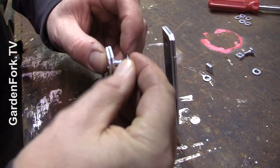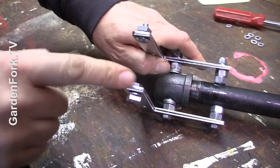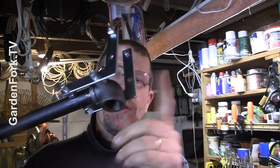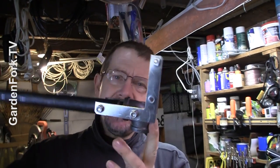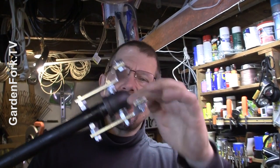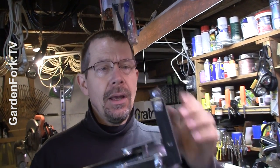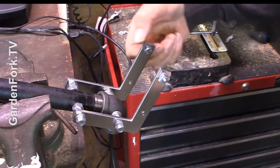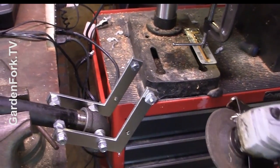Now the fronts of the brackets are held together. Assembled here. My thought with the elbow is it would provide increased leverage when you're bending back on the pallet — be curious to see how that works out. I like it. There's no welding and you can get all this stuff at your hardware store. Our angle brackets have a little sharp edge here and I'm just going to round that down so it doesn't punch holes in the pallet wood.